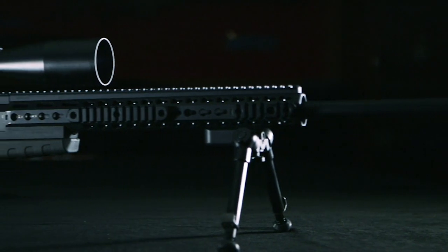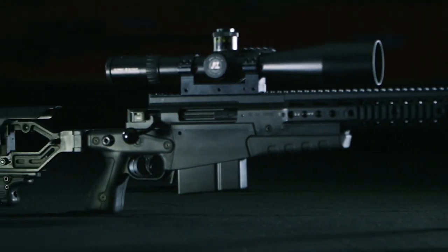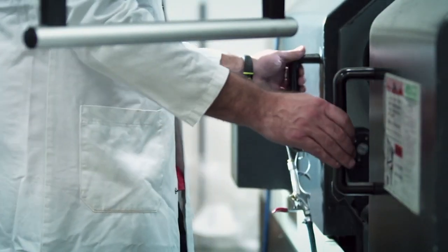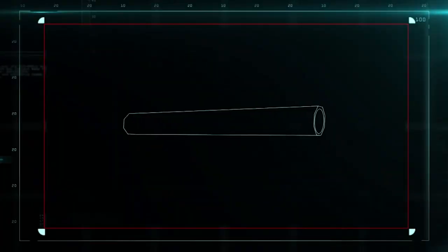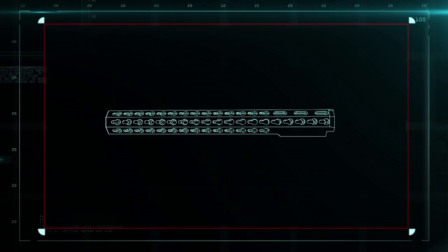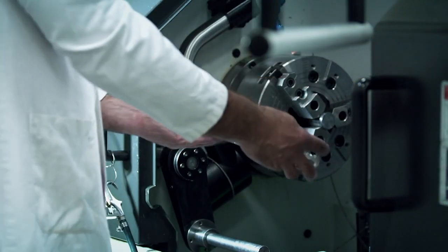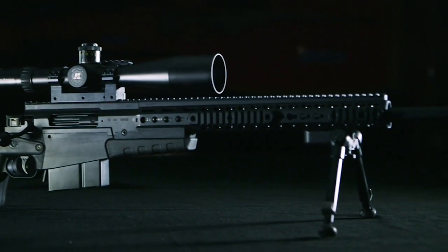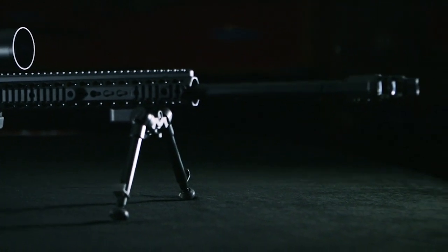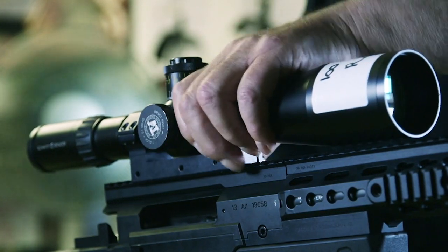The mounting tube is an innovation developed to fasten night vision, lasers, and other accessories to the barrel. It starts as an aluminum cylinder, then is milled into an eight-sided shape with over 100 key slots drilled into its sides — the attachments hang off the slots. The mounting tube is free-floating, designed to fit over the barrel without touching it, so the weight of the attachments won't put the barrel off balance and affect the aim.